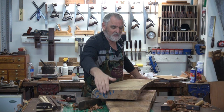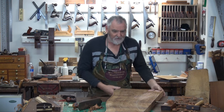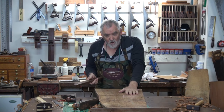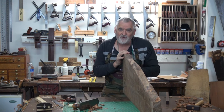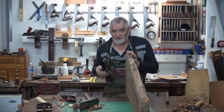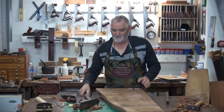So this first one - I'll see how much of a winder it's got in it. What I want is this wide section to actually be the top. This underside is the bottom. So for me, the crucial part is to get this dead flat without any twists and warps. If this has got a couple of twists and warps in it, I can cope with that for how it's going to be made. The number one priority is to get the top flat.